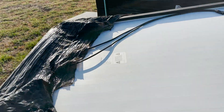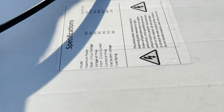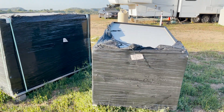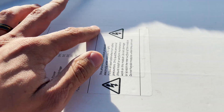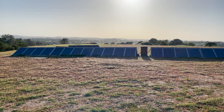Some of you may have heard about the Trina Solar panel recall — that's what these are. If you look on the box they're Trina Solar panels, but if you look at the label there's actually a label underneath with a bigger one put over it. These panels should never have been able to be bought; they should have been sent for recycling and destroyed. What happened is Trina Solar had a massive recall because the back sheet — this part of the panel right here — was failing and allowing moisture in, causing poor performance. So whenever you see Trina Solar panels with the brand name on the box but no Trina Solar on the sticker and that little bump, those are not good panels.